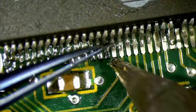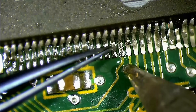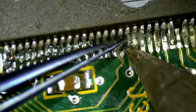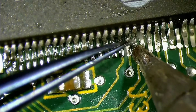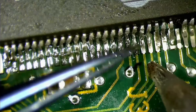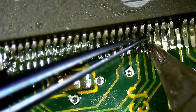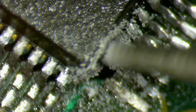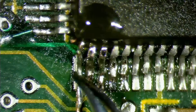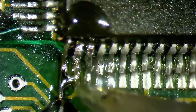After about 10 minutes I was done with this work as well. Surprisingly, it wasn't as difficult as I thought. Unfortunately, two pins broke off or were already gone — we will have to install a wire to replace those pins. I did replace pins like this on a Voodoo card once, but today will be different. I have to drill a little into the chip to uncover more of the remaining copper connections in the plastic housing; otherwise there just isn't enough material left to attach a wire to. I am using an engraving pen to remove parts of the housing. Since I do not want to unnecessarily damage the surface on top, I drill into the side of the chip, uncovering just enough to attach a wire. Now we can go ahead and solder a short 0.2mm wire to those two places.